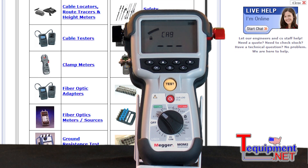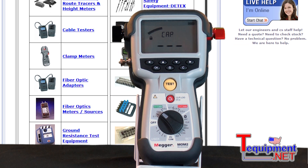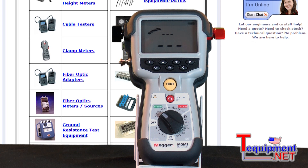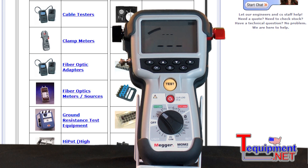For larger size circuit breakers you need more current to see if there's any kind of oxidation or any kind of pitting that's occurring between the joints of a circuit breaker. So you need a lot of current to measure that, and the lower the resistance you see on the instrument shows the quality of those two contact points for service.